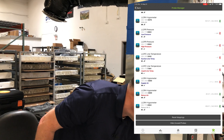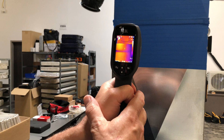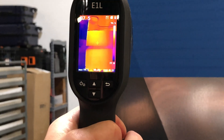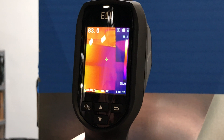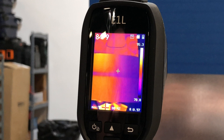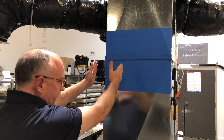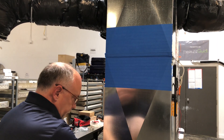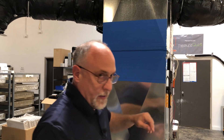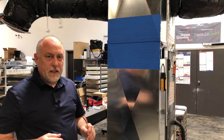So the moral of the story is that if you're measuring return air in a single location, it's going to lie to you. If we take the thermal imaging camera now and look at this ductwork, you can actually see the gradient — half the duct is hot and the other half is cool. The reason this happens is air is very laminar in a duct. When we have a leak on one side, all that hot air is going to go down that same side. If you're measuring on the other side, you're never going to see that return air leak. One solution is to use multiple probes, and that's definitely a good solution.